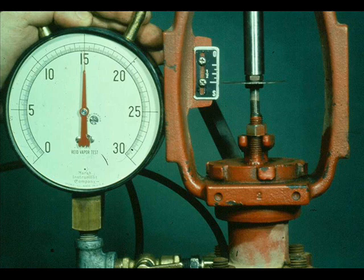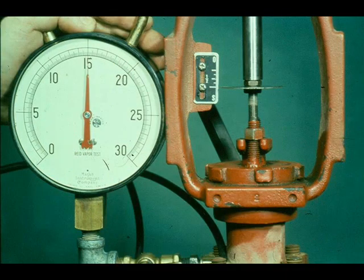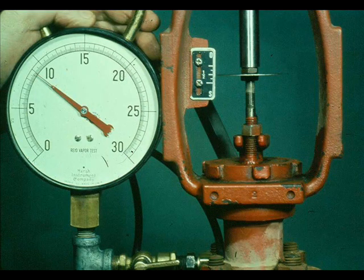Slowly apply air pressure to the valve and observe the valve stem travel. Note the input pressure needed to seat the valve and make adjustments if necessary. You should make the valve barely seat at 15 PSI. Then lower the pressure and screw the plug stem out two revolutions. Lock the lock nuts, check the valve for hysteresis, then commission it.